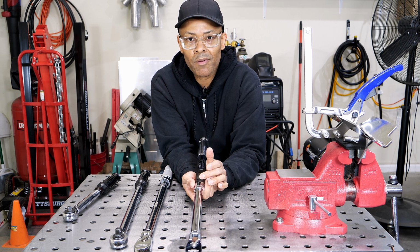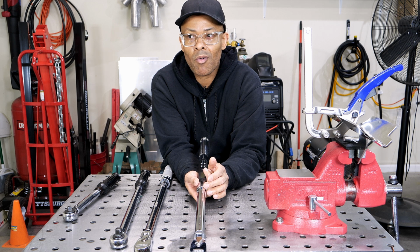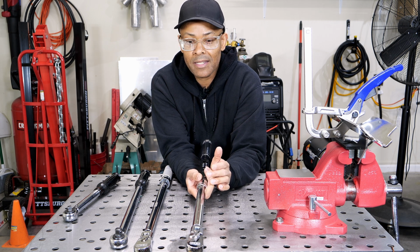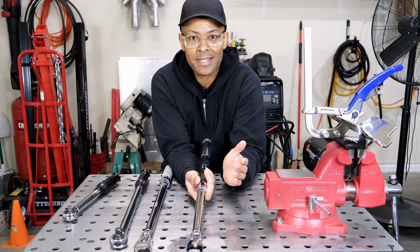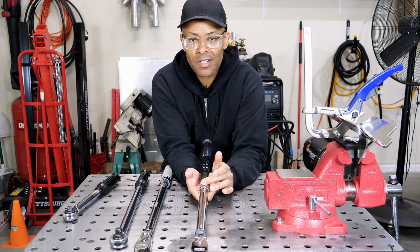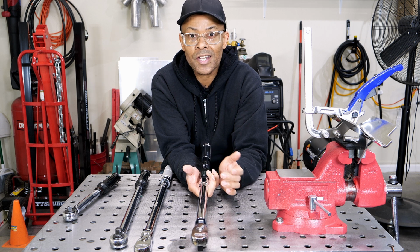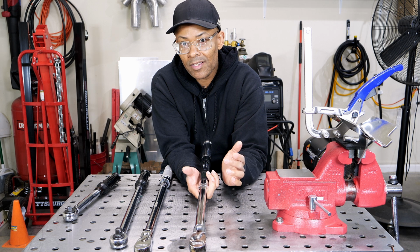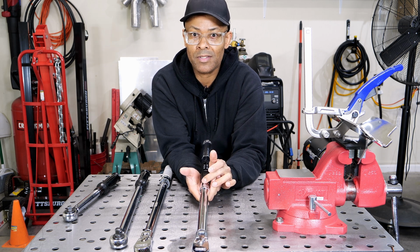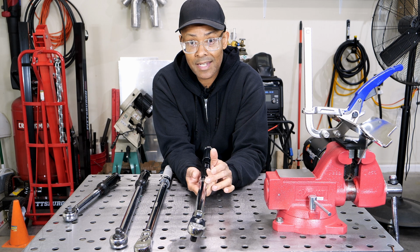Now, let's say we torque something down to 150 foot-pounds, and then it requires a 180-degree angle after that. I don't know the math on this, so I'm just giving an example, so don't quote me on this in the comments. But if you torque something down to 150 foot-pounds, and then the torque angle after that is 180 degrees, and going 180 degrees maxes out the maximum torque value, which is 250 foot-pounds on this wrench, then your wrench is going to vibrate and let you know, which is a nice feature. So it's like that safety feature.